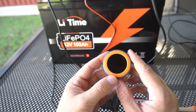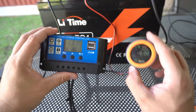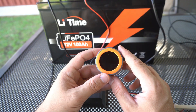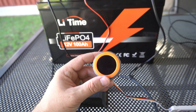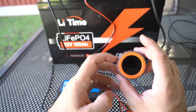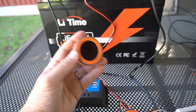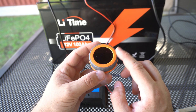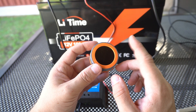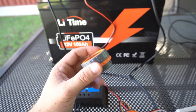So how did I destroy the old battery? To destroy a battery you need to discharge it beyond a certain level. These two devices were able to discharge my old battery in just a few months because the solar panel was not properly connected and I forgot to monitor voltage, because I accidentally destroyed the receiver part. I destroyed it by connecting it to my laptop charger — my laptop also has a USB-C port for charging but the voltage in that adapter is way higher than 5 volts.